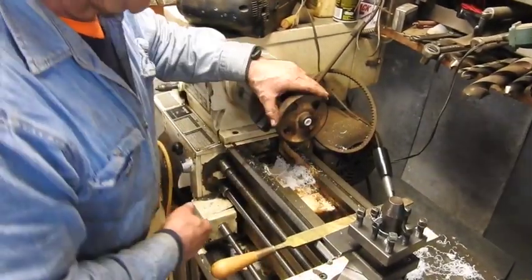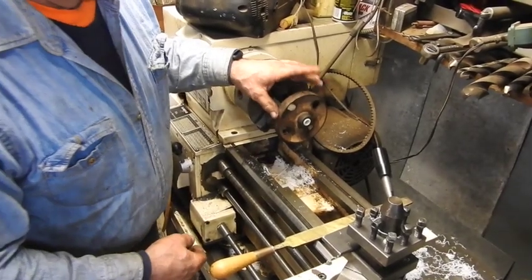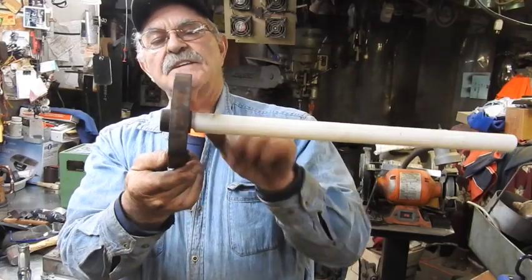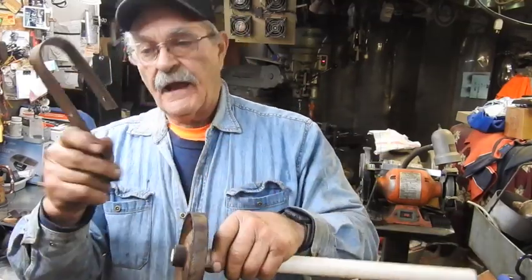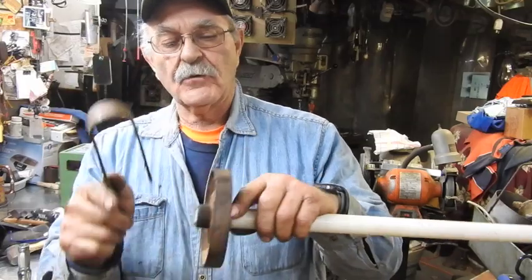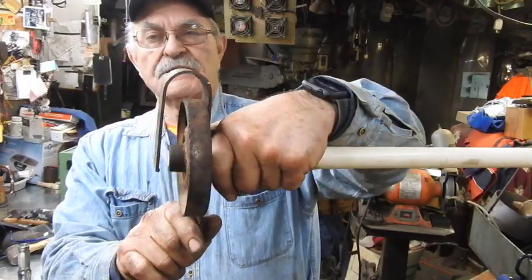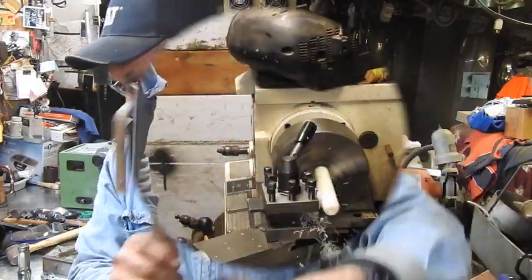There we go. So now I got to duplicate this 4 times because I've got four wheels to go over for the 2 doors. We'll cut that bushing off right there flush with the outside edge of the wheels, and then we'll bore holes to match the bore here, and then that's the size of the axle we'll use, and that'll go right over the top of this, just like that right there, and that should be our wheel that's going to run down the track.